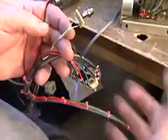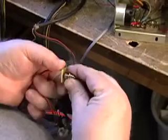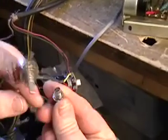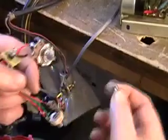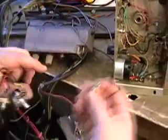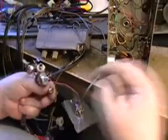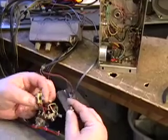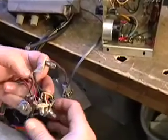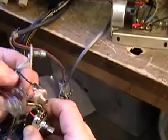then this will all be put together for you, and all you have to do is just pull this off and loosen the nut and the washer, put it through the 5/16" hole in your cheek block, and put the nut and washer on the other side, tighten it up, and simply just push the LED into it like that. And everything will be all straightened out.